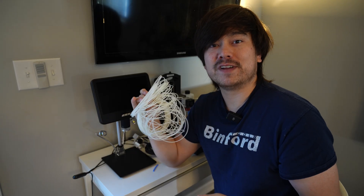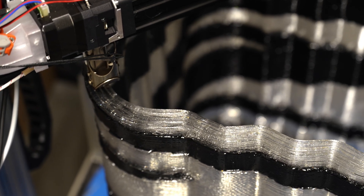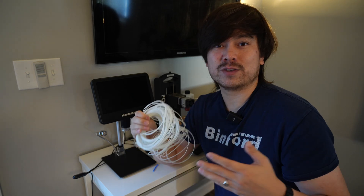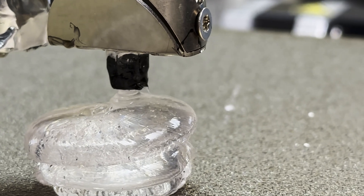What you could do instead of throwing contaminated filament away is put it in a 'contaminated box' — filament that you know might have some debris on it — and just run that in your larger diameter nozzle printers. I recommend always having one of your printers with a larger nozzle diameter: 1mm, 1.8mm, 2.4mm — just something really wide that'll pass whatever filament you send through it without nozzle clogs. I also really like the way that large nozzle diameters print, so every now and then just fire up some fat nozzle prints and you'll have a good time.